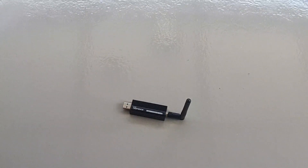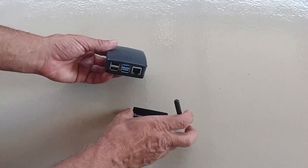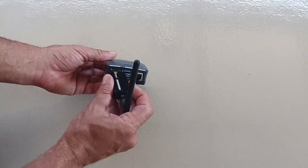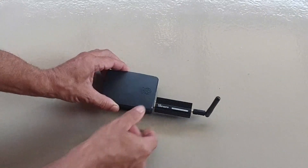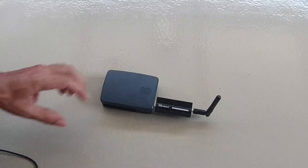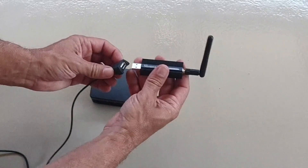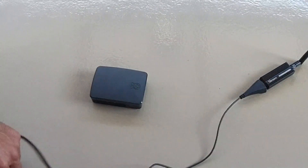Now we have the Raspberry Pi. The Raspberry Pi has four USB ports. Zigbee doesn't use much data and it's not very fast, so you can just use one of the standard USB ports to plug it in. It's not usually recommended to plug it straight in because there are possibilities of data interference with the dongle being close to the computer. So the recommended method is to use a USB extension cable — you plug into the extension cable, and then plug the extension cable into the Raspberry Pi.